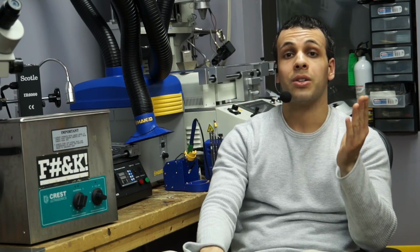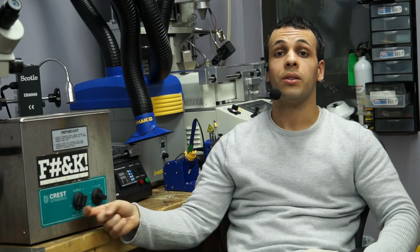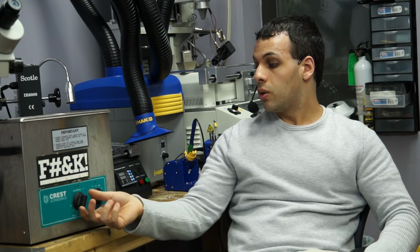Don't be an impatient person and say, I'm going to get this done now. I want to go home earlier. No, wait till the thing hits 60 or 65. Don't accidentally turn it all the way up, have it at 80 Celsius, and then pour your board in there. Go do something else or talk to a customer and come back 20 minutes later so your board looks like the one that I showed you.